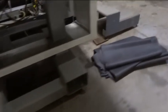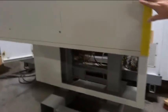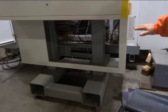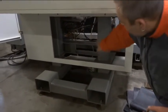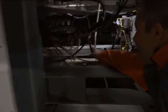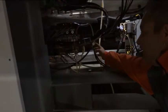When you have everything plugged in, you can have the tool changer unit to the machine, right? But I would leave it a little bit off, so that you have a good connection here and can go inside and connect your hoses. We have 2 hoses here, they're all marked with wire ties. There are blue wire ties, yellow wire ties. This is for 2 of them, for door open, door closed.